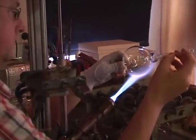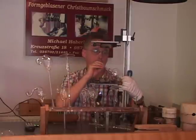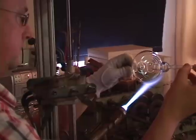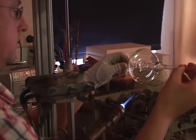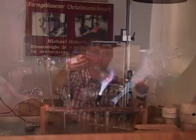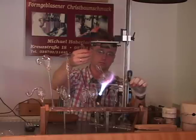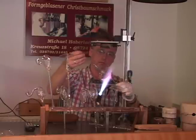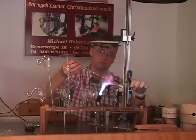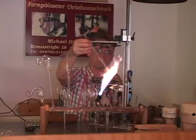He heats a very narrow section to create a crisp delineation between the top of the cap and the underside, or the mushroom's gills. The point is removed, the cap is reheated, and then he draws off the excess glass. Another puff restores the shape, and then it's time to flame anneal.